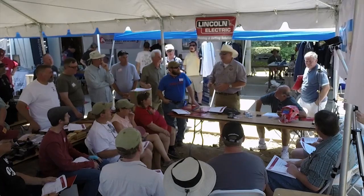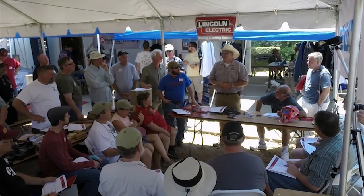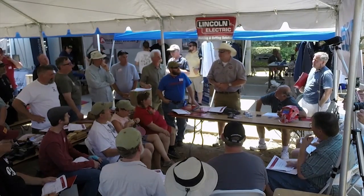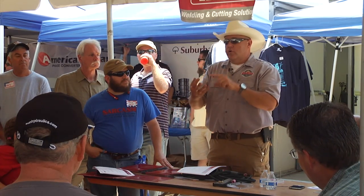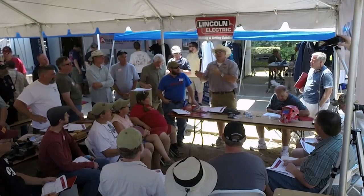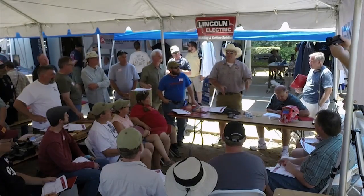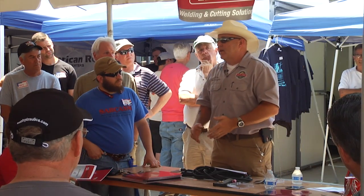There are a lot of aluminums, especially some cast alloys, that just don't weld. Does anybody wonder why they rivet the skins of airplanes on? What they put into that alloy to get the ductility, corrosion resistance, and extreme strength for being very thin makes it a non-weldable alloy — so they have to rivet them. There are about 7,000 aluminum alloys, and when welding aluminum, the filler metal has to be paired to the base metal.